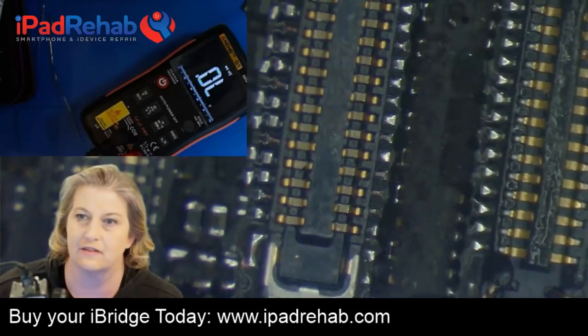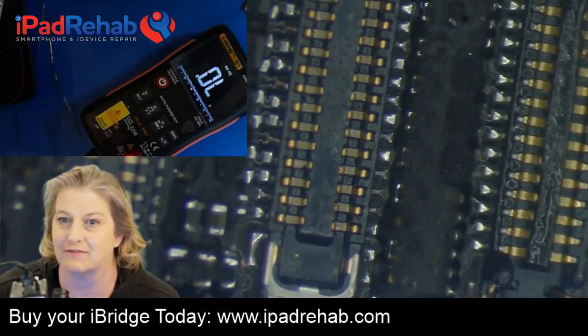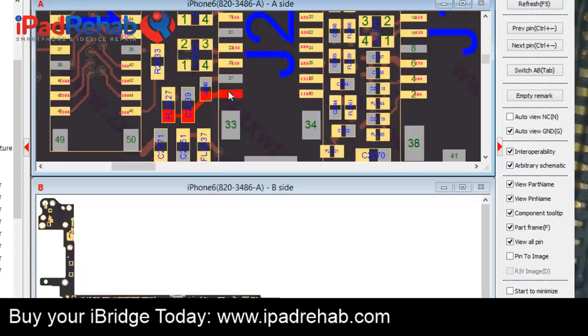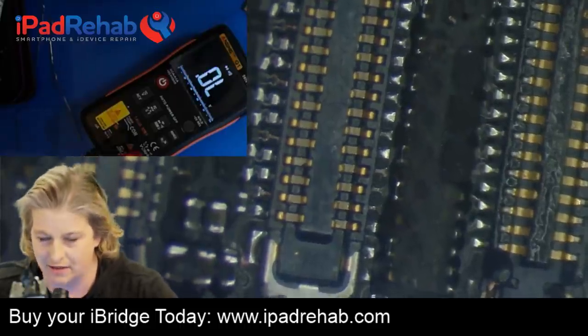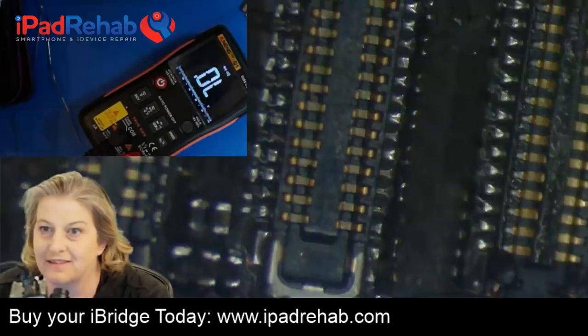Let's check on ZXW. Let's check by showing you ZXW. Here we go. Now let's check from pin 29, where is that filter? Oh, it's right nearby. It's that guy right there. So the bottom side of the filter connects to the connector. The top side of the filter connects to all of the rest of 1V8. So let's check on that then on the actual board. Let's put our eyes on that thing. And that's the spot right here that kind of looks grungy. So that definitely makes sense.